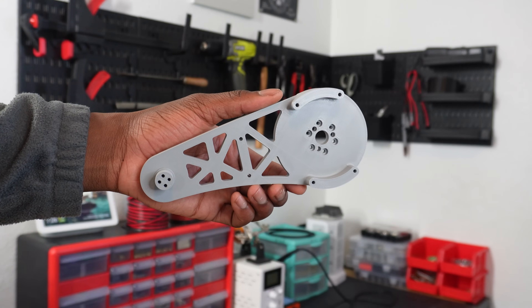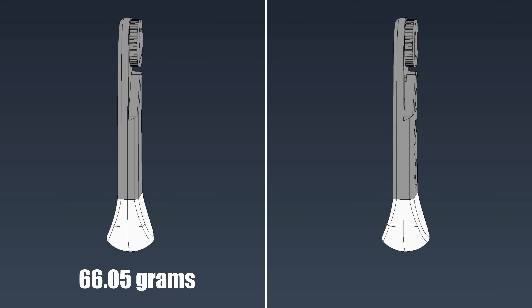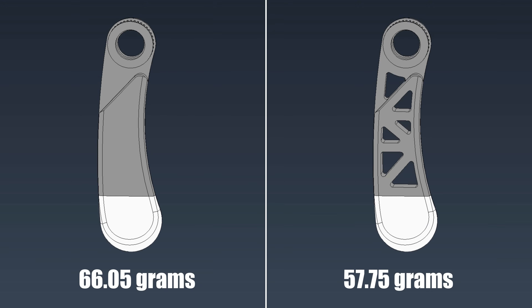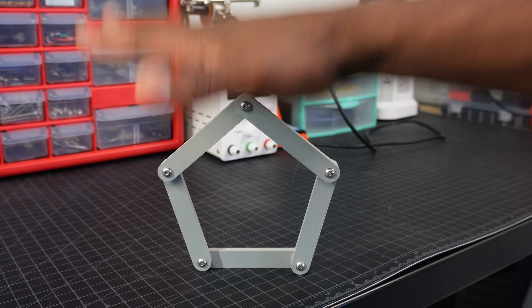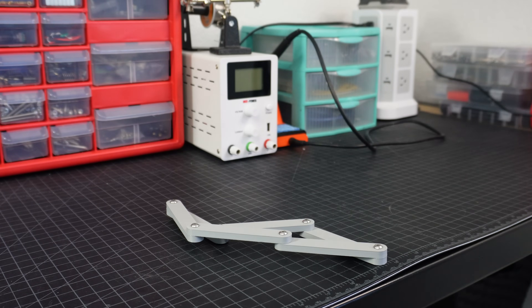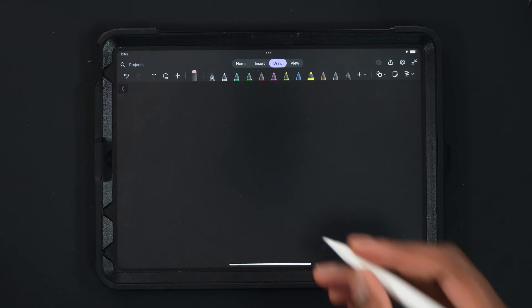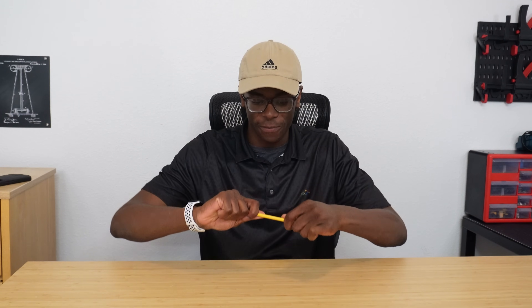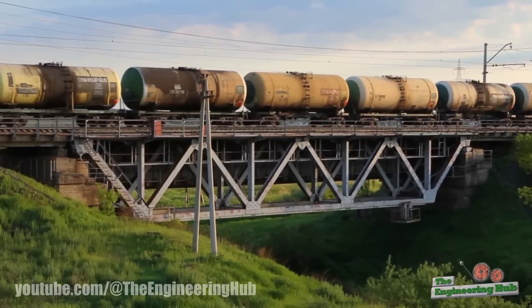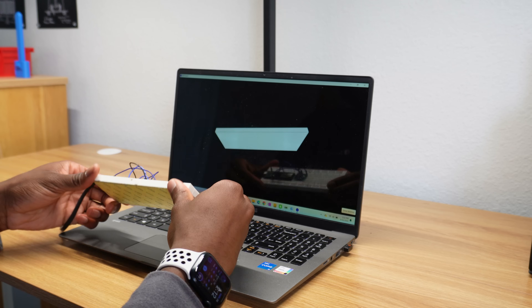Something you'll notice about the robot's design is that a lot of the parts have triangle cutouts. This was done to keep weight down while also maintaining structural strength, because a triangle is a really strong shape. If you build a bunch of shapes with linkages and pin joints, each shape collapses when you apply a force to it — except for the triangle, because triangles are inherently rigid. Applying a force to the corner of a triangle causes each of its members to become axially loaded, meaning it experiences tension or compression. It's generally much harder to break things with an axial force than with a bending force. This is why triangles show up in bridge and roof designs in structures called trusses.